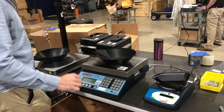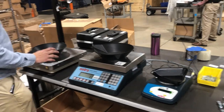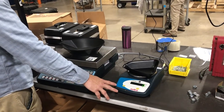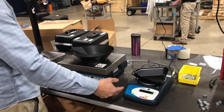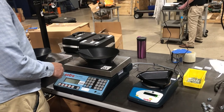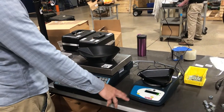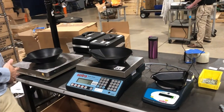The key is, this scale is more accurate than this scale, and this scale is more accurate than this scale. The key to accuracy is capturing the average piece weight for the part itself. So if you have a really good average piece weight, you're going to be much more accurate. Even if you're off one or two counts — if you're off one or two percent — you could be off hundreds of pieces. That's why the three-scale system tends to work nicely together.